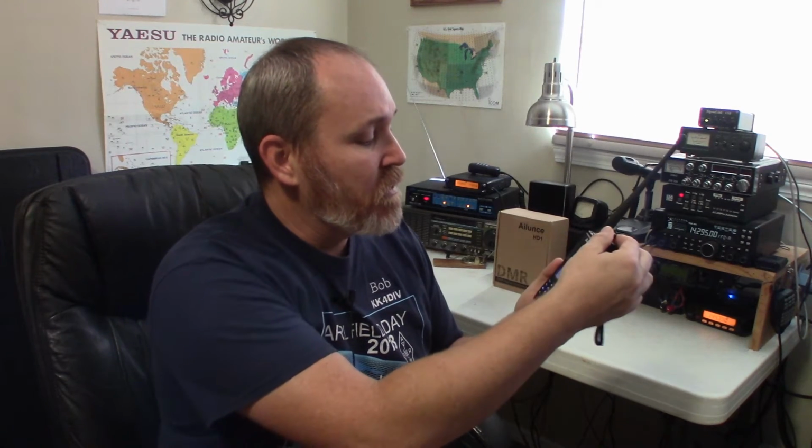So I have the top band as my open spot zone. The bottom band, just the same. I have that set for the Panama City repeaters, so you can see it says PC repeater in the zone. It gives you the channel slot. Tells me I'm in low power, wide for wide FM. Tells me it's CTS, that I have a tone put in here, which is a 100 hertz tone, and FM.